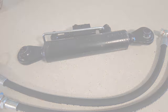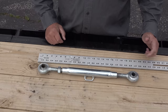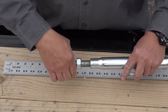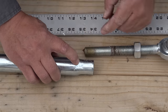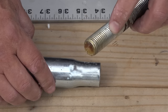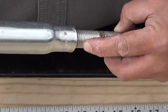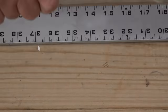So now we're going to show you how to buy the correct hydraulic top link. You're going to start with your manual top link off your tractor — loosen the nut up on top and unscrew each end off. The top link threads start at the very beginning and go to about this point, so your threads need to be at least that long, maybe a little bit longer. I'll put my fingernail on it and spin it up to it so I know that side is fully extended.